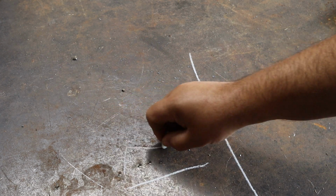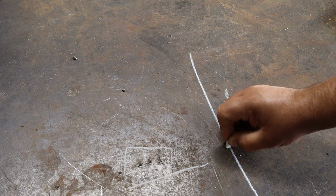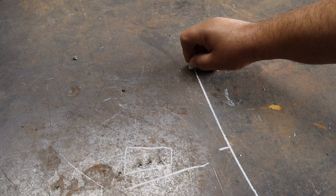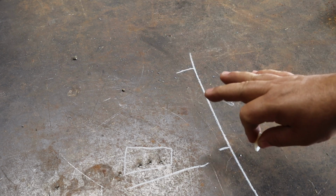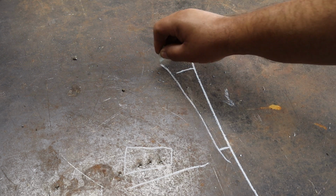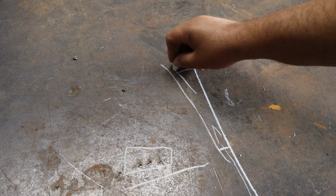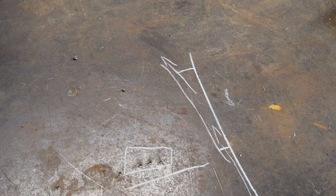This is the plan. I'm going to draw you a master diagram here. Here's the wall. Here's the workbench where the forge will be. Okay? So behind the forge, I'm going to put a bracket here that's 3 inches long and here that is 4 inches long. Not to scale. Our tin will be mounted to these brackets so that air can come into the bottom and go up through the top, and it'll dissipate the heat and the building won't catch on fire. That's how it works in my mind.